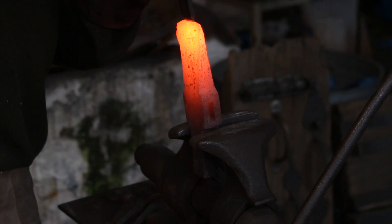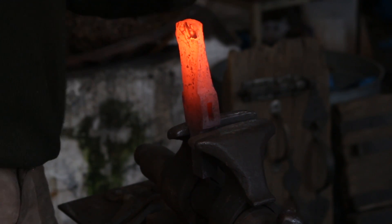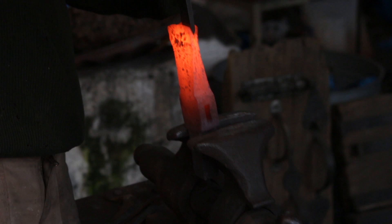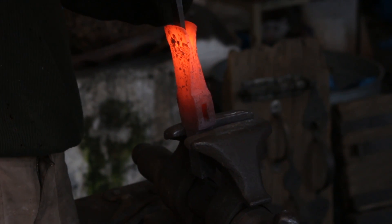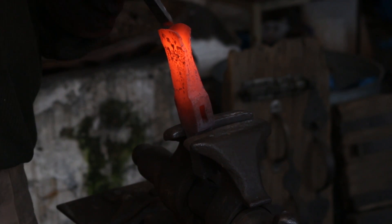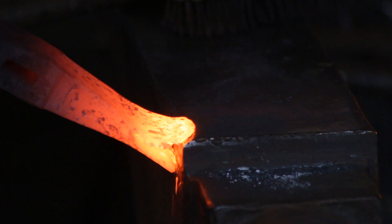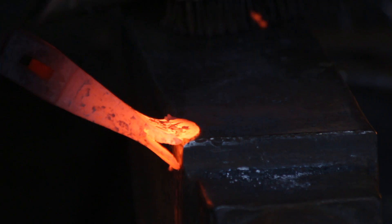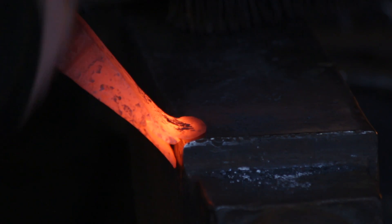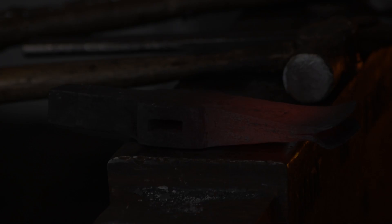Once all that dressing and shaping is done I will take my chisel again and just go back in and reopen that v-groove. Because I've drawn it out quite a lot, you will see that it is lovely and deep. The final thing I will do is just scarf the edges to help it weld a little better. I've actually done this longer than the high carbon steel insert is going to be, and the reason I like to do that is that it actually protects the steel by enveloping it in wrought iron.